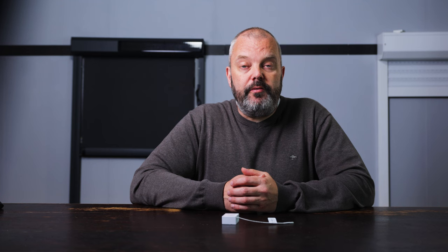What do you use an in-wall receiver for? You build it into the wall behind your in-wall switch so that you can operate your roller shutter with a remote control. You can continue to use the switch in combination with a remote control, but you don't have to — you can also just use the module and leave out the switch. With remote control you can open and close three roller shutters at the same time with one press of the button, for example. The exact number of modules you want to control is something you can determine yourself.